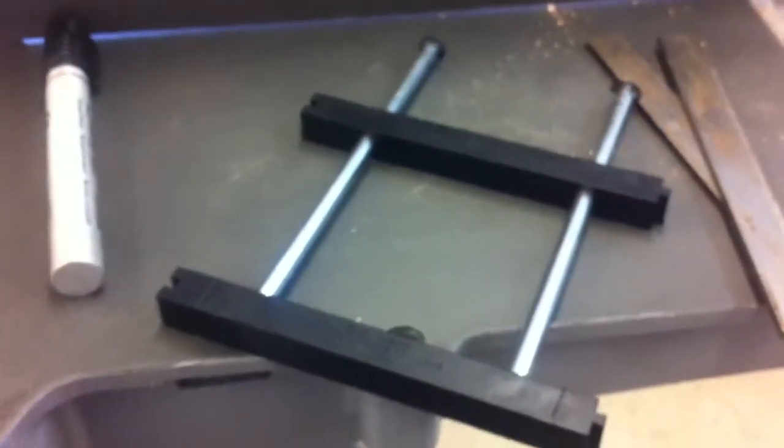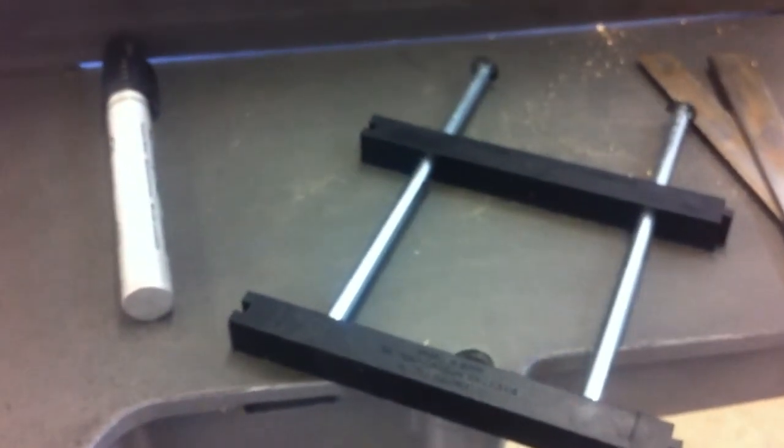So I've also bought this tool to help set the knives. So I'm just following the directions that they have there. The first thing you do is to find top dead center. I used an old knife, and I put it here and worked that back and forth until it was just touching the top of the blade and moving it just a bit. I transferred that mark over.